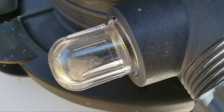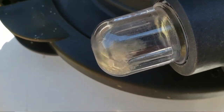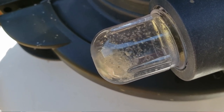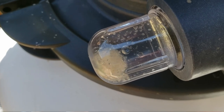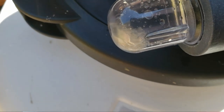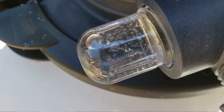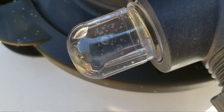The next setting is rinse. After backwashing for three or four minutes, your sight glass on the side of the pump is going to fill up and eventually turn clear with sand settling in the bottom. At that point, turn on the rinse feature — all of that sand will be sucked out and go through the drain the same way as backwash, except the valve is in a different position. You're not backwashing through the sand anymore; you're rinsing out the valve and getting rid of all that dirty sand.